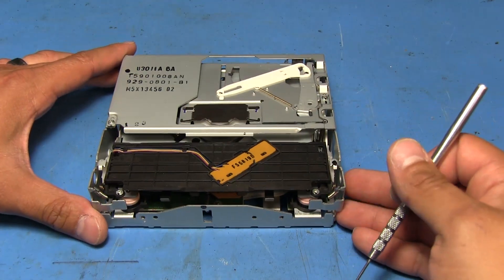The gears are mounted underneath this little enclosure that kind of pivots. Right off the bat I can see there is a hairline crack on that gear. Let me get the macro lens so you can see it better. You can tell it's cracked in several places — not just one. The main crack is right there, and you can see it's spread out toward the middle of a tooth and off to the side. There's also another smaller crack on this other side. What it does is it just slips on the shaft when you're trying to load a disc.